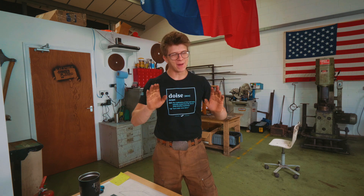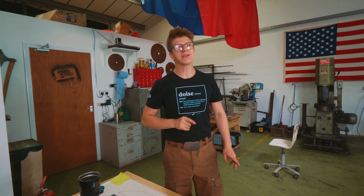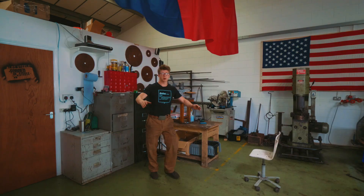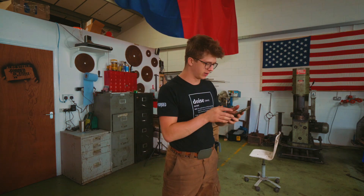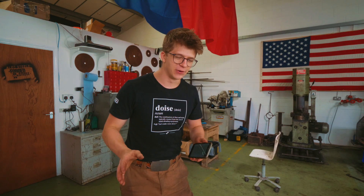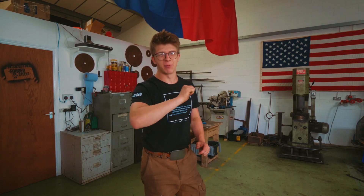So now is a good time to backtrack on a lot of the historical facts that we pointed out a little bit earlier. I have been told that they are wrong. I think the main problem is what these books call a falchion, from which Alex did his research, is probably pretty broad and encompasses more than really what it is that we're trying to do — which apparently is not a Greek hunting weapon, but is a Northern Italian or Southern French just weapon. I've been given some incredible information by James Elmsley, who is a very smart man on the subject of the falchion. We have been set straight. I've also been given some great tips on the actual thickness of the blade that we need in the distal taper.